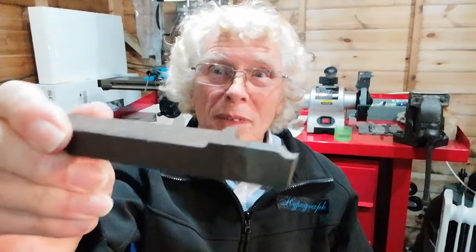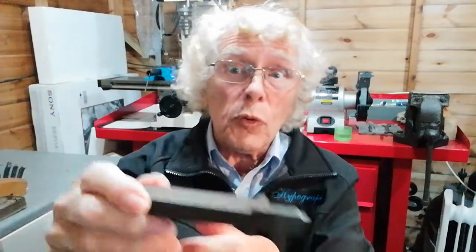This is the parting off tool. It seems straightforward, but believe me, if you don't get the angles correctly set in the tool post, it can cause some problems. One in particular is chattering of the tool — not a smooth parting off procedure because of the chatter — but we'll look at ways to cure it.